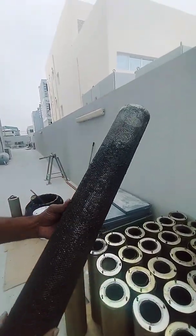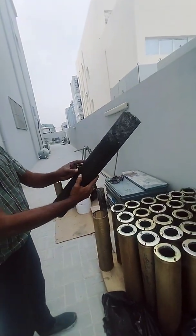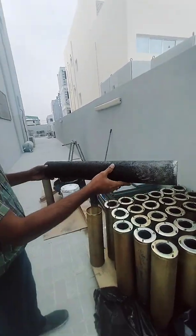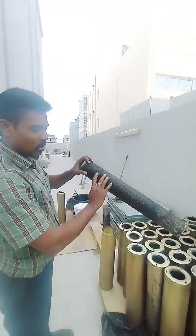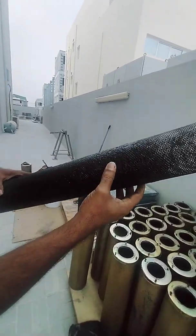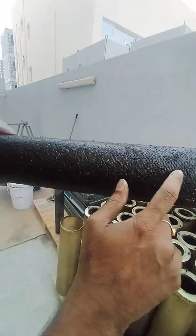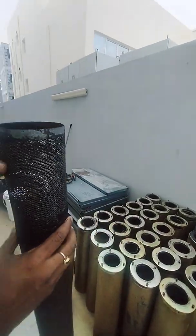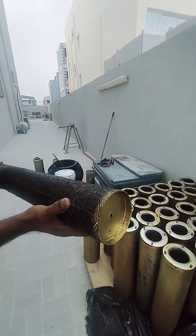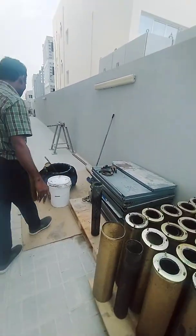See how dirty this one is on the inside — totally blocked. There is no air circulation. This is from the oil and all. We dried it out just for the video. There is no porous, there is no hole opening for the air to pass through. The total is blocked, so there is no air passing. In these cases your Ecology unit pressure drop will come higher and the power consumption is much more higher. More smoke cannot pass through on the air handling units.